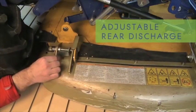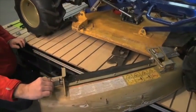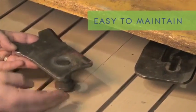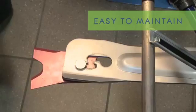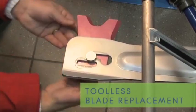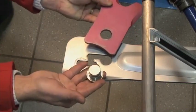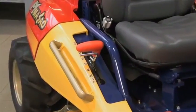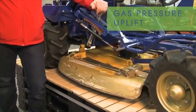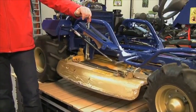The side covers can also be positioned horizontally to allow the trash to be laid out beneath the rolling chassis, or opened wide enough to have access to the cutting area, making blade inspection and servicing extremely easy. The blades are retained under the deck by a unique patented system that is tool-less and very easy to do in the workshop or out in the paddock. Each blade is made of a special high-carbon Hirosaki steel that has incredible strength and ability in rocky and rough terrain. The height adjustment lever has gas-assisted struts, which makes lifting the deck a breeze, and it can be raised and lowered in small increments.